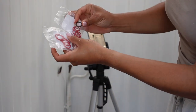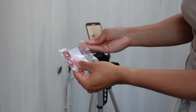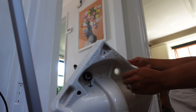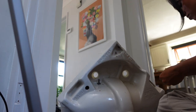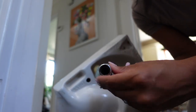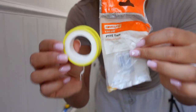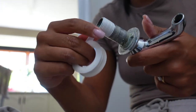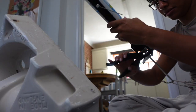I'm matching up which washer fits — these are the half-inch ones for reference. This sink, this whole bathroom, hasn't been maintained in about 30 years. I'm taking out the old taps, removing all the gunk from the thread, cleaning the hole, and then going in with some PTFE tape on the male part before closing it all up so it should be watertight.